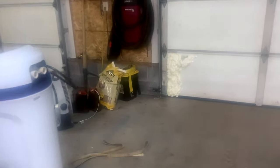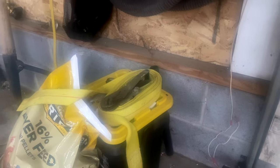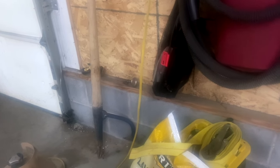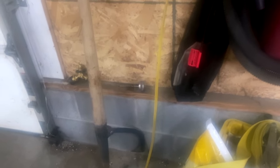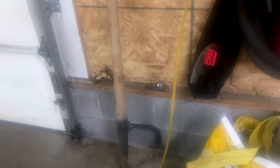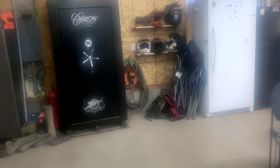Here's a view of the regular concrete blocks right there. On the outside of those concrete blocks there's two inches of foam. We actually laid the blocks a little smaller than our final dimension — about five inches smaller — which allowed for two inches of foam and a half-inch of dura rock that we screwed in through the foam into the blocks. So when you look in here it just looks like a concrete block. But if I was to do this again, I would use ICF — I'd put one course of ICF, fill it solid and rebar it down into the slab. We weren't doing ICFs when we built this one, but we don't do a lot of block work now.